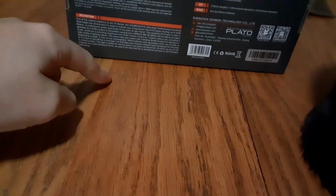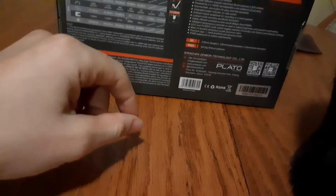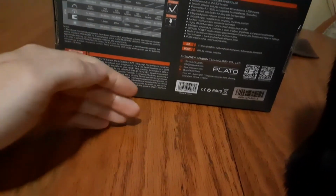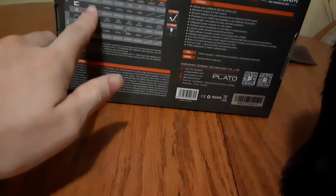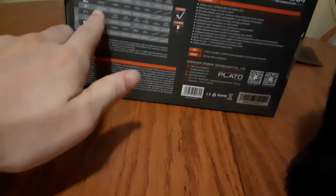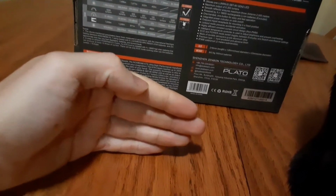So the more intensity you have, the more real life throw you have. That's true. So if you grab a 1 million candela flashlight, I should be able to see the difference in throw, because a 1 million candela isn't going to go as far as 1.5 million candela. So the farther it throws, ANSI is also true. But does it really mean that I need twice the throw to see twice the brightness? No, because usually when you double the brightness, you increase the throw by, say, 50%.